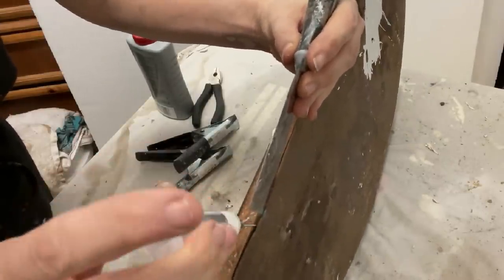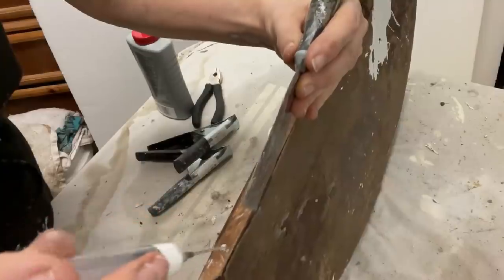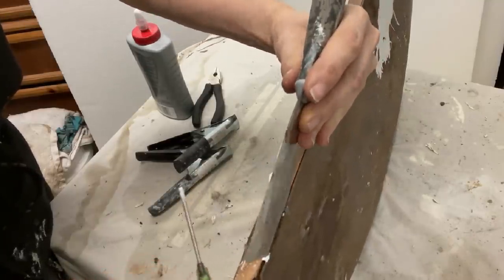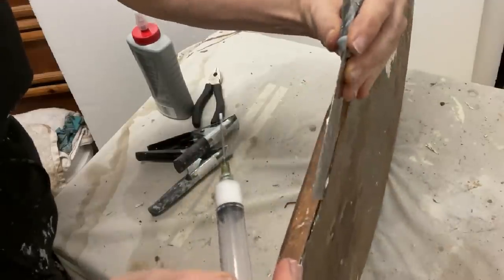The top veneer was separating in about a 6-inch strip. I used Weld-A-Bond multi-purpose adhesive glue to fill the void. I found it easiest to insert the glue in the void using a syringe. A putty knife was also used to allow space for me to insert the syringe.